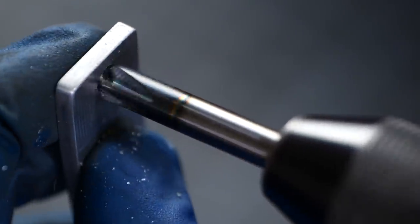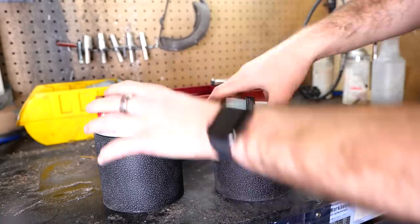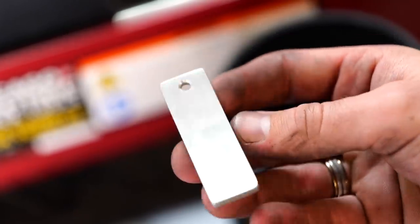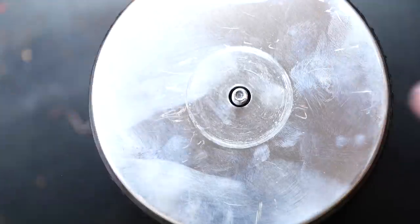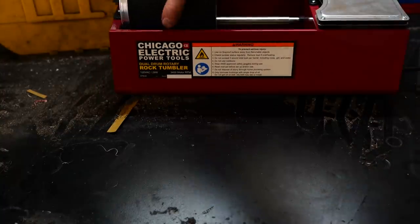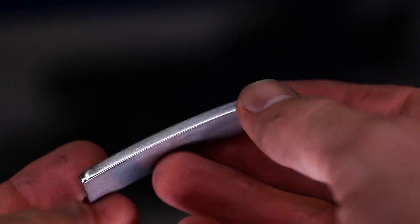Now it's time to move on to the finishing steps. I want to give it a really nice even consistent finish, but it's really challenging to do that without removing the texture that was left on there from the lathe. So my best option is to use a rock tumbler. First I'm going to be using a really rough coarse grit of aluminum oxide — I'll leave that in there for about 24 hours, that'll really even out the surface and give us a nice smooth texture everywhere. You can see just how nice that turned out. And then to get a finer finish I'm moving on to the next step, which is walnut pieces that have been impregnated with a polishing agent, which will really help bring out that final shine. Here we are a day later and you can see just how smooth and consistent that finish looks — it looks amazing.